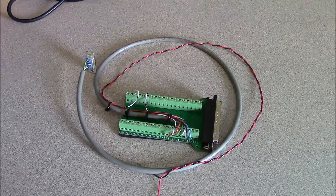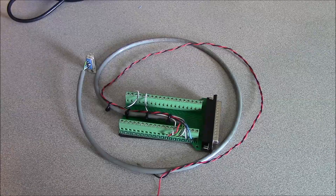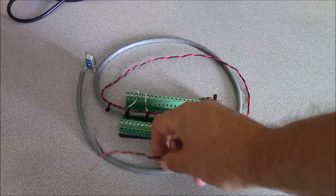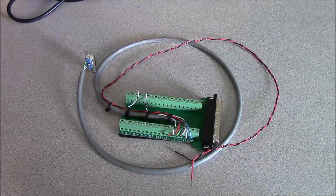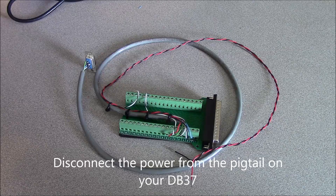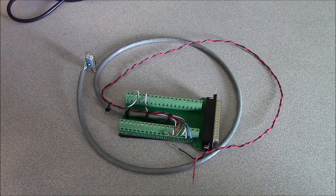Well there you have it — the do-it-yourself GE Orion programming cable. Apparently this will also work on the Jaguar 725 and the 7100s, but I don't have those radios so there was no way to test it. The important thing to remember is to make sure that you power cycle the board between read and write cycles. Once it successfully completes the cycle, go ahead and disconnect your power from the radio. Then when you go to write the radio, reconnect your power, sally forth and save the radios. I hope this helps. This is Brett from Survival Comms — until next time.